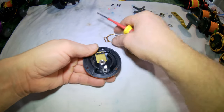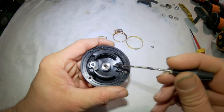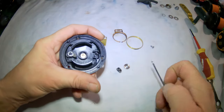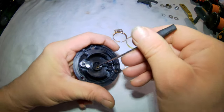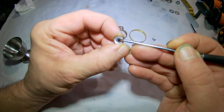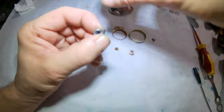Remove the clicker mechanism and the brass plate. Then with the bench screwdriver, take the little washer off and take the bearing out. Under that you've got a brass plate — take that out and give it a clean. The way to check whether you've got a good or bad bearing is to just move the inside of the bearing. If you feel movement it's okay — clean it, re-oil it, refit it. If it's not moving inside, the bearing is seized and you'll need new bearings.